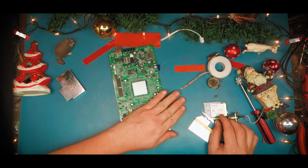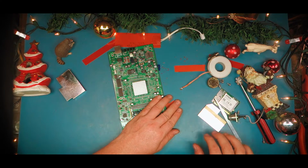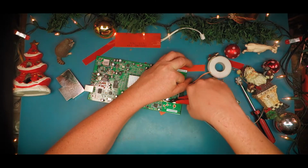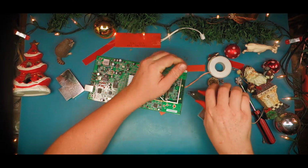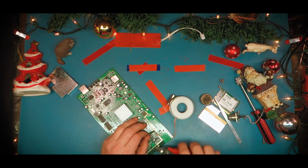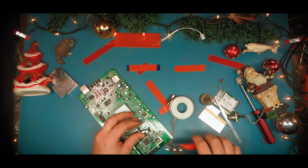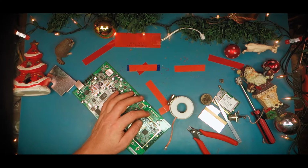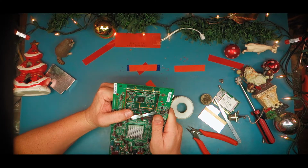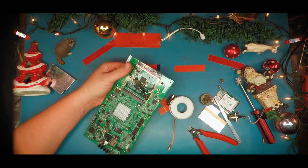And guess what? Before you even look, can you guess what the chipset is? Put it in the comments below. What chipset do you think this is going to be? I'll give you 3 guesses, because it's a 2.4 radio. It's the most common chipset on the planet, originally owned by Qualcomm. Atheros. What is the actual chip here? It is an Atheros AR2414A-001. Ha! How cool is that?